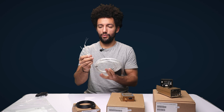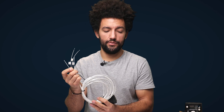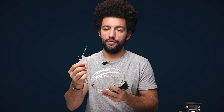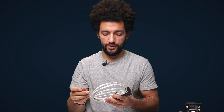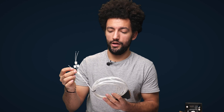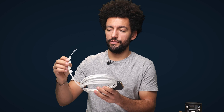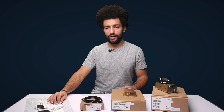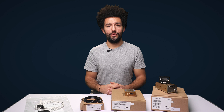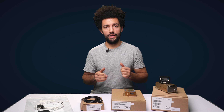You've got some loose wires — two of which go to a GPS input, in this case the TN72, so you wire two of these onto a plug for the TN72. The other two wires go to your aircraft power — 11 to 33 volts DC and a ground input. In addition to supplying Trig harnesses, we also supply any type of transponder antenna, whether externally or internally mounted, and we can supply custom-length coaxial cables with the correct connector for your requirements.